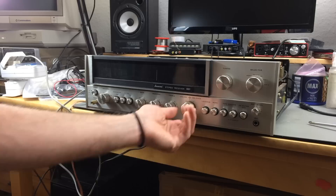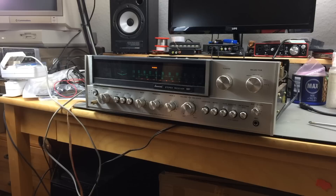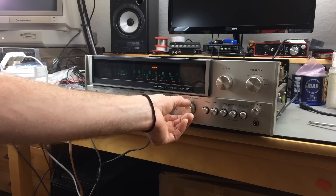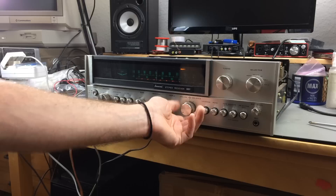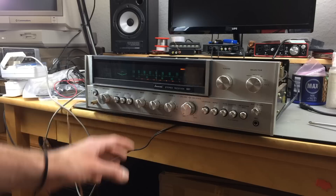Quick function test - turning the speakers off and the volume down before turning it on. Turning it on. The relay makes a ringing sound there, that's nice. And it hums on the speakers - that's the sign. There's a hum, and a distinct noise. There's like a mains hum on the speakers. I don't know if you can hear that on camera, so I'm reproducing it.